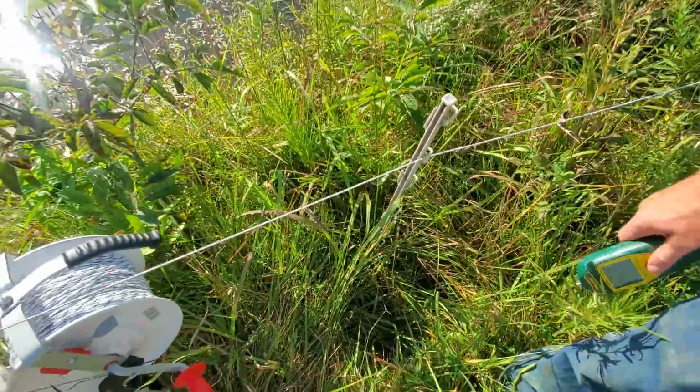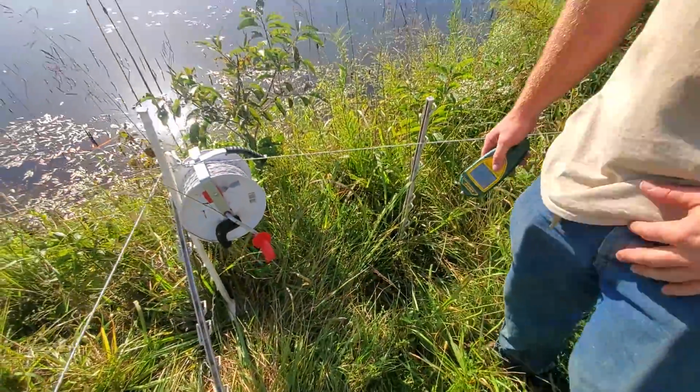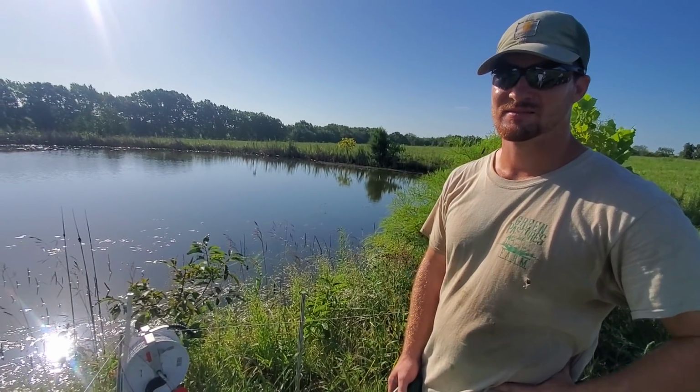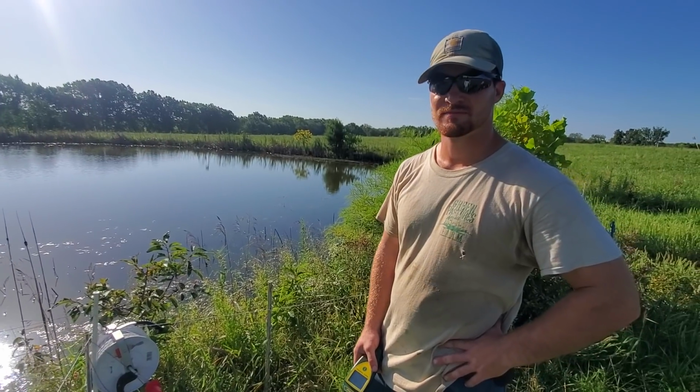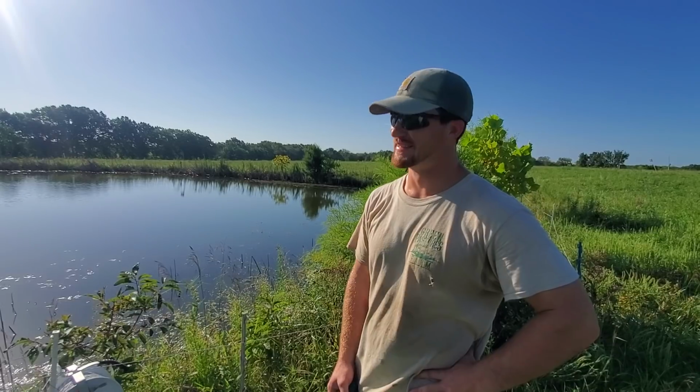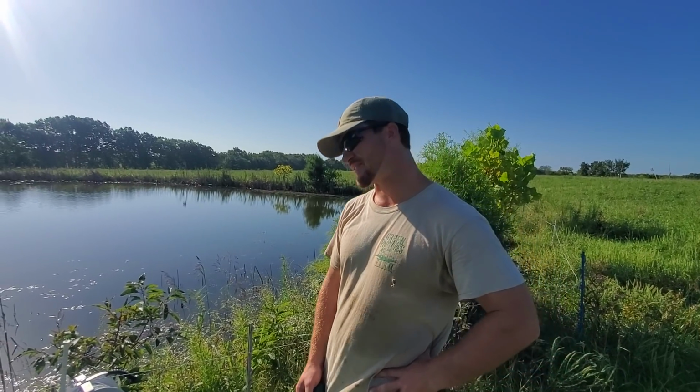Connor, you act like you're talking from experience. I've been hit a couple times. It's not fun. Anything above 6 really hurts. It hurts bad, doesn't it? Yeah. And so I tell people, electric fence, it's not a physical fence, but it's a psychological fence. Cattle hit it one time at 10 kV, they're not coming back, are they? Not for a long time.